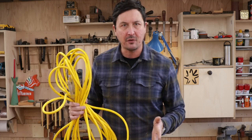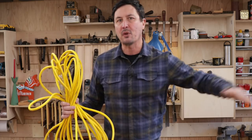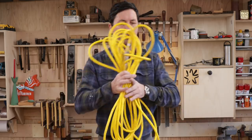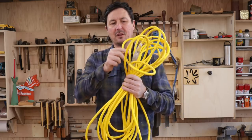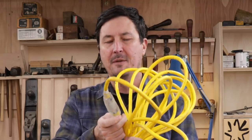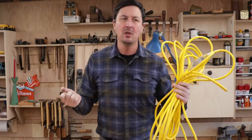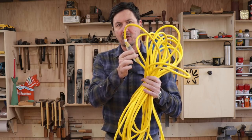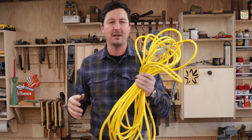If you're going to have a cord inside a woodshop or a small garage where you don't plan on stringing stuff out all over the yard, get a 25-footer. I would recommend getting ones with a light at the end of the receptacle. It's aggravating not knowing — you pull the trigger and it doesn't work. Is it my tool or is it the cord? With the lit end, you can quickly tell if you've got power. It makes life a lot easier.